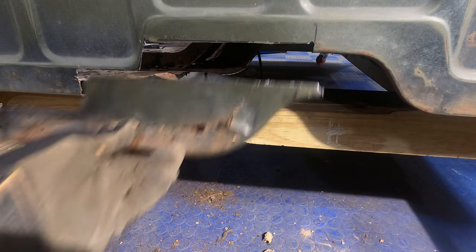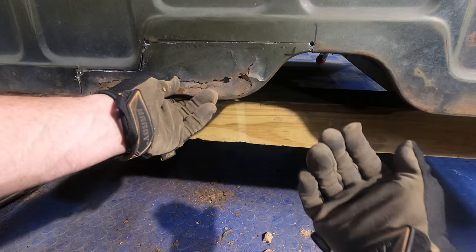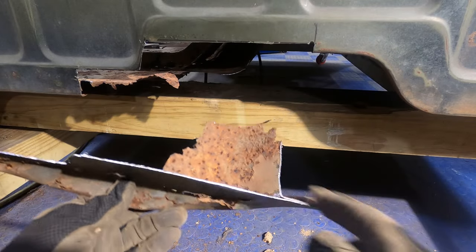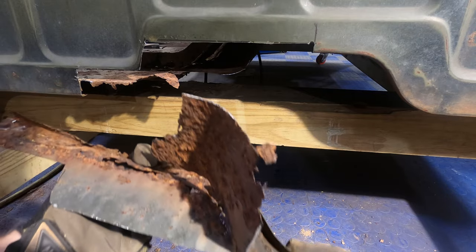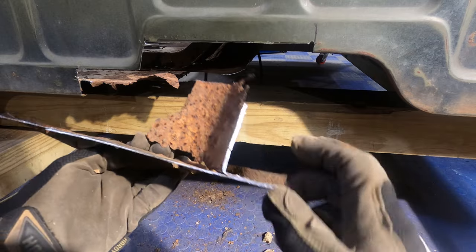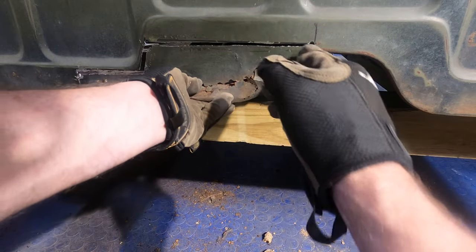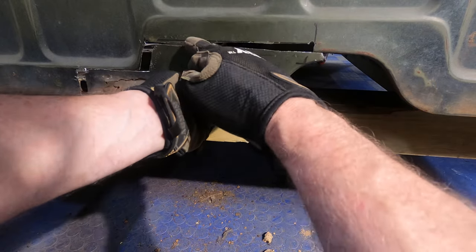What we had to do, in case I did miss that, this is inside, and there's the tunnel here for the drive shaft to come through. That tunnel comes up here, and as you can see, it's pinch welded, and it's like little spot welds in there, actually. The lip on the backside of this sheet metal right here was against this piece of material, so we had to cut through the top of the tunnel when we went across.